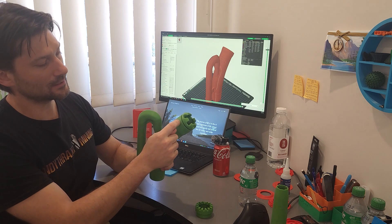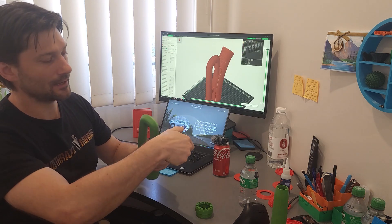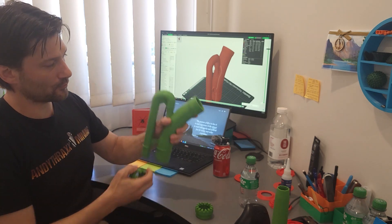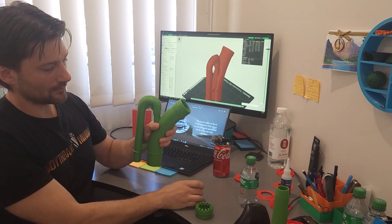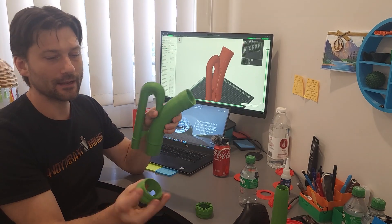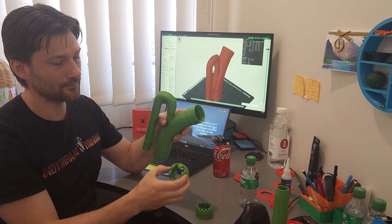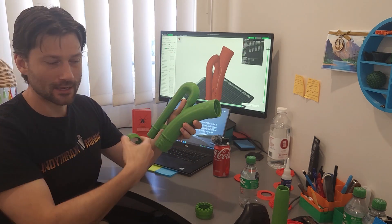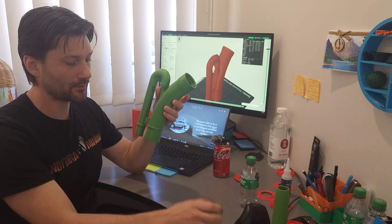The tip here you print out separately. I glued this on with CA glue. Basically you have to print threads vertically on a 3D printer — you can't print the threads at an angle like this — so that's why this was printed separately sitting flat. That then allows you to thread on different nozzle tips, so this can be a wear item; when it wears out you don't have to waste all this plastic, you can just print another tip and screw that on.